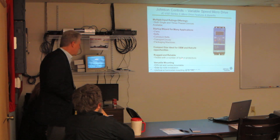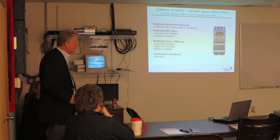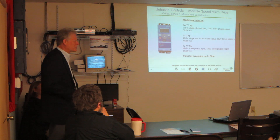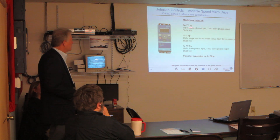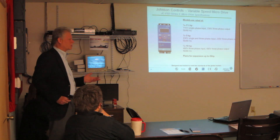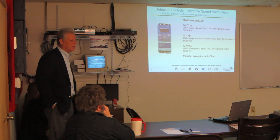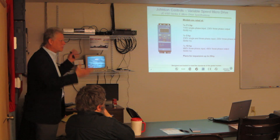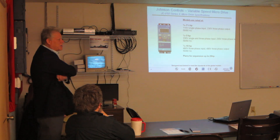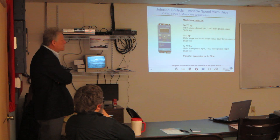I've already shown a lot of contractors and people these, and they already want demos. I keep wondering why everybody wants them — and it's because they want 115-volt single-phase input and to make 230-volt three-phase output. I don't know if they're controlling rooftop condensers or something else entirely, but you can do 115-volt single-phase input converted to 230-volt three-phase output, 50/60 Hz.